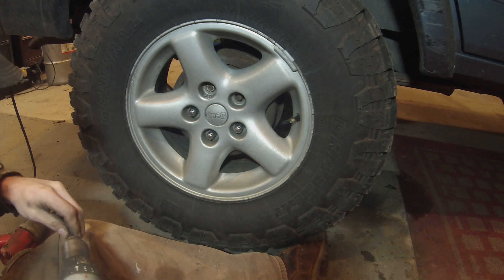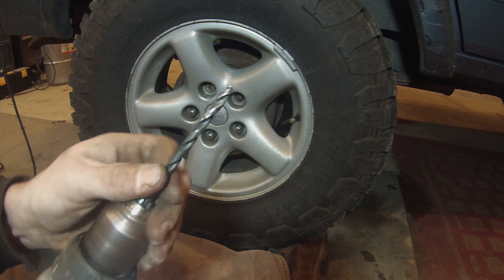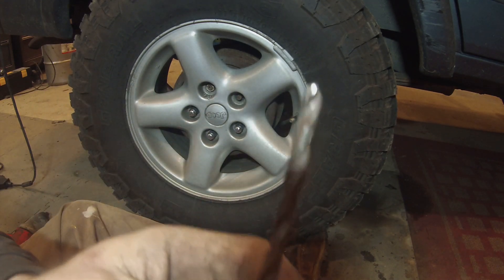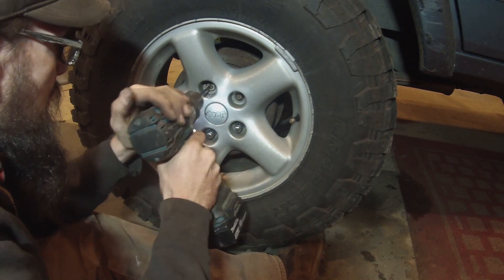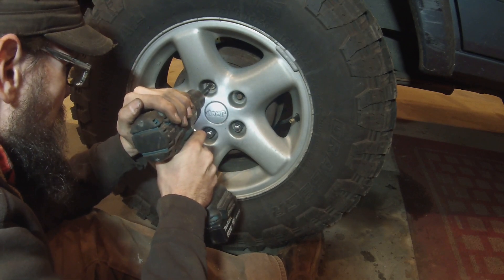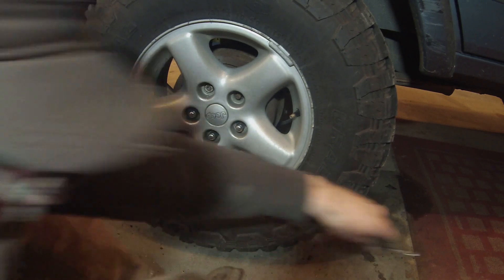Time to move up — 3/16ths to a 1/4 inch now. Start small, go bigger, work your way up. It's tough after you get the pilot hole in — a good bit for the second one because it grabs right away. But it drills right through. Done.